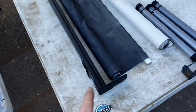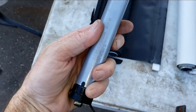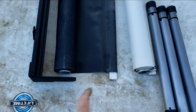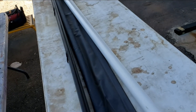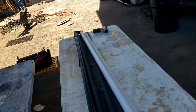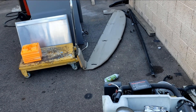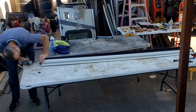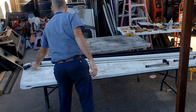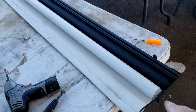Now this isn't a shade how-to video, this is a rebuilding vlog. These are Automotion shades — it's etched right on there. They actually have a PDF you can download to show you how to rebuild these. That spring is going to take 14 turns, and remember it's trying to help it wind up so don't go the wrong direction. I'll get this put together and then start working on that guy. Like that — this thing should be rebuilt now.